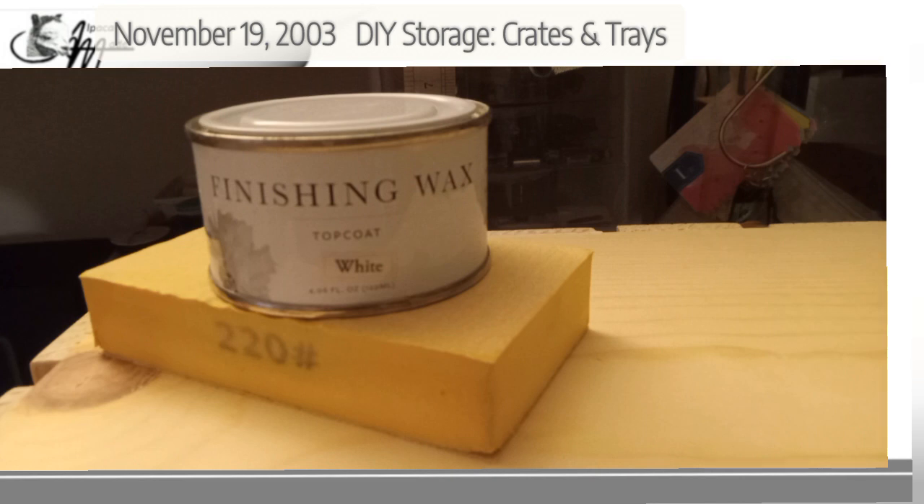I actually wanted the wood grain to show through. So instead of painting or staining the conventional way with a brush and liquid stain, I used a white finishing wax, which really doesn't stain it white — it only evens out the color. These cheap woods usually have two-tone patterns. Think of plywood and how unattractive it can be if it's stained depending on how it's cut. I want to avoid that — I just want something that's a light color and shows the wood.